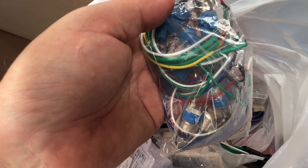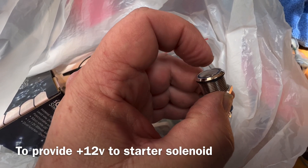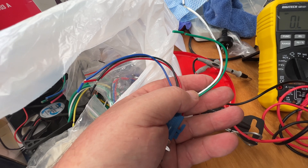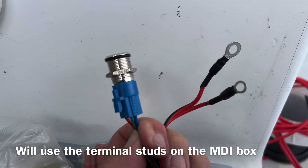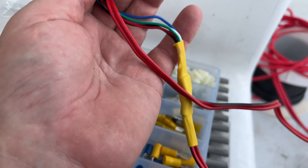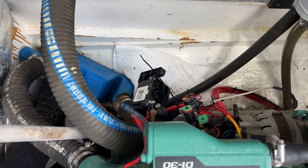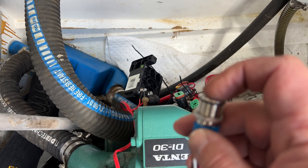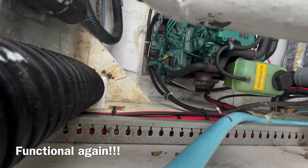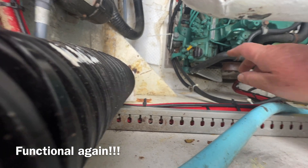The bag of switches — this appears to be a momentary; we'll check it with the multimeter. White and green is normally open. We have terminals to go on the box and the momentary on-switch attached to some cable. I've connected batteries, start, and I put the glow plugs back on just to keep them out of the way. Press the button. I'm kneeling just outside the engine bay, so I can start that and then lean down and get the stop.